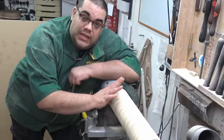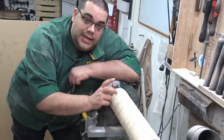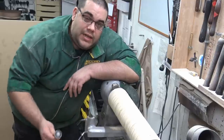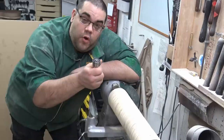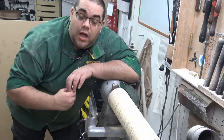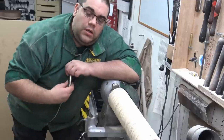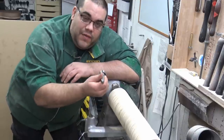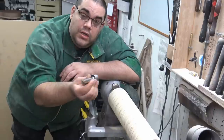So that's it rough turned — it's only very roughly turned, it's not out of balance anymore and it's a bit more stable, so I can get the speed up. I'm going to have a go at drilling with a Forstner bit into the end of it. I want to use this revolving arbor — it's got a bearing on it — and this is what I use with my sphere cups or cup arbors or cup chucks. I ideally want to use this at that end to support it. It's got a two Morse taper for the tailstock — it should sit in there.